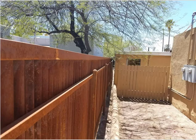One that we did like was on the other side of town. Again, they have smaller stock, smaller vertical posts other than at the end and around gates. In this case, they screwed it from the other side. They used self-tapping metal screws. And again, they went with two posts, and they had a nice topper. This is called a J channel. It just snaps right over the top.